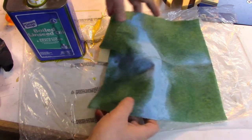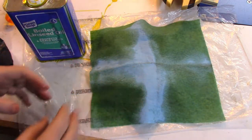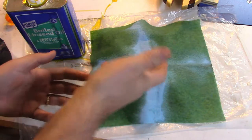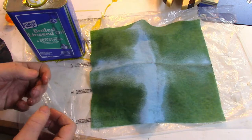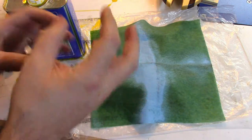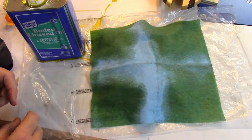When you're done with your BLO, don't just wad up the rag and throw it in the garbage. BLO cures exothermically, which means it creates a lot of heat as it dries. That heat could cause the rag to catch fire, and if it's in the garbage, everything in the garbage will also catch fire and you could end up burning down your shop. The best thing to do is lay it out on flat concrete or ball it up and put it in a jar of water. I'm going to lay it on the concrete and I'll be all good.